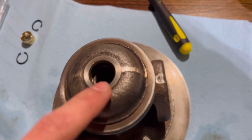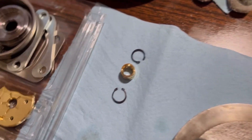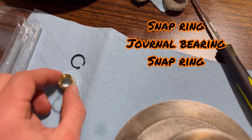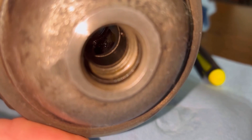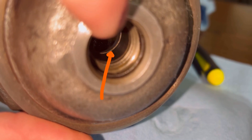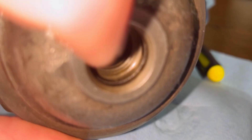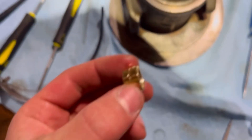I'm going to go from the back side first — you can go from the front side if you wanted to, it doesn't really matter. For this side, you have a snap ring, journal bearing, snap ring. The furthest little divot is where your first snap ring will go. In between that black space is where the journal bearing goes, and then you can see there's another divot. First one's in, next is the journal bearing. I got this oiled up — didn't put too much on, just enough.